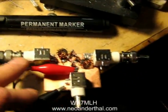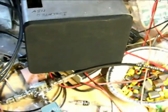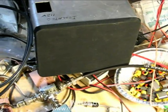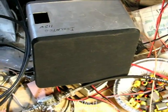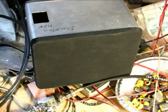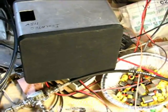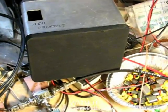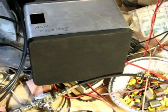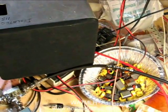The output of that mixer is just alligator-clip leaded at audio into a little box here that I made — essentially just an audio amplifier with a volume control. It's set up to be the audio interface for the 50 ohm outputs of a diode ring mixer, so that I have a generic bench amplifier to simply hook onto things and get some audio gain. And here's what some of the audio is sounding like.